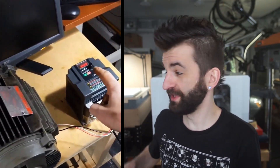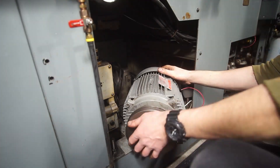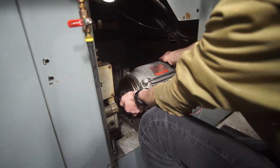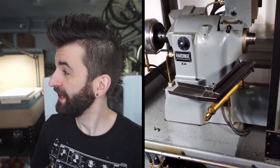I did some quick checks on the torque to make sure the motor would still turn all the belts and pulleys — there are like 15 belts under this thing. Once I was happy, I put the motor back in the lathe and bypassed all the clutching mechanisms and mechanical speed changers to get the spindle spinning. I let it run for a while to let the belts warm up and get the flat spots out. I ran a dial indicator across everything and all the specs were well within factory specs, so that was a huge load off my mind.